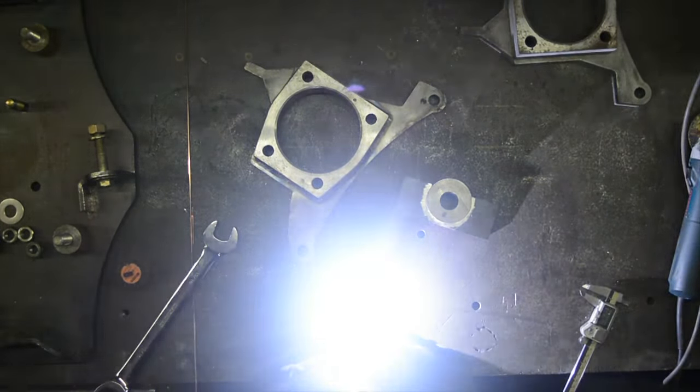You can see how that bolt slips out of there. It means we haven't warped any of these dimensions when we're putting this in our fixture. So this should just lift right out like that. And you can see you're starting to take shape. So we'll weld all of this side and then start fitting the top together.